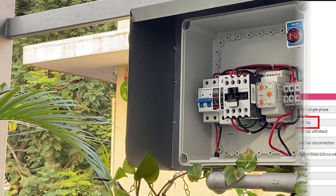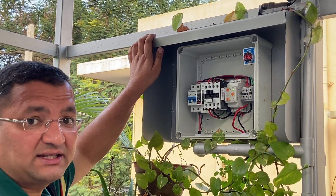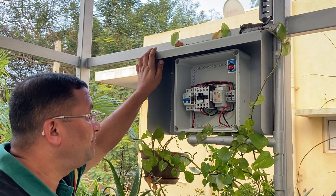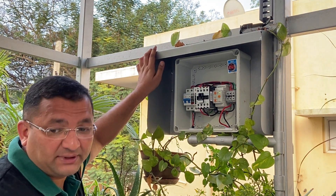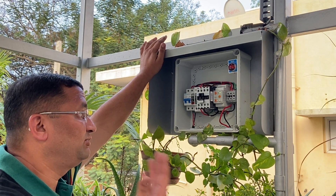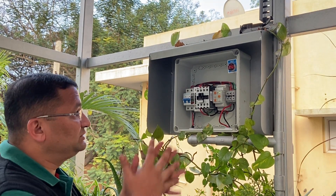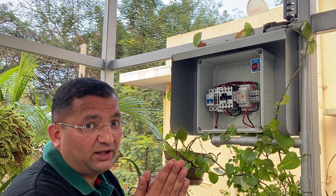We also have an over voltage protection relay. If there is a high voltage from the power utility grid, this is used to cut off and isolate our microinverter — the circuit opens up and the microinverter gets isolated from the grid. We have used a conventional relay and a signal contactor for this purpose. It is important to test this before it is commissioned, and we will show you how the relay and contactor behaves under high or low voltages.